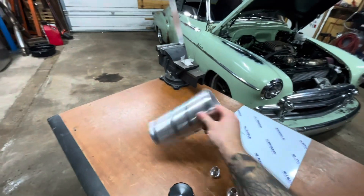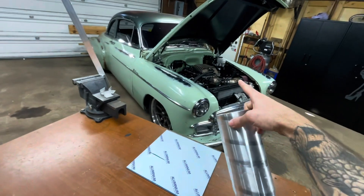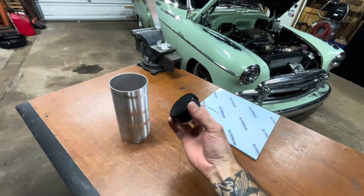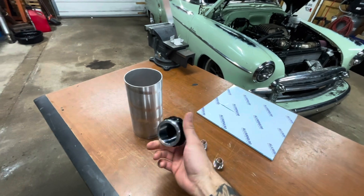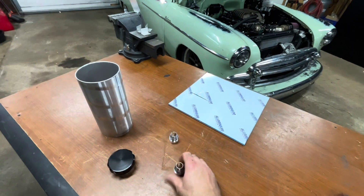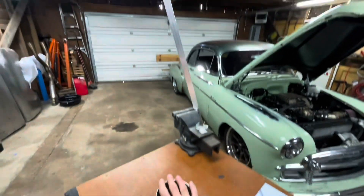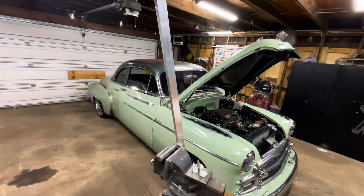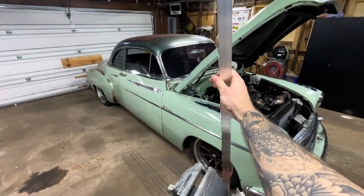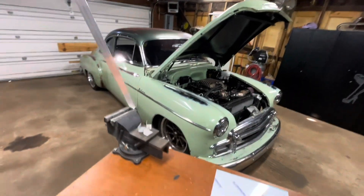Material-wise: 4-inch aluminum tube — I use this for all my intake stuff, but it's just a leftover scrap piece. Got a weld-in aluminum cap, about 15 bucks on Amazon. 12 AN bungs for the inlet and the outlet. An eighth-inch plate aluminum for the cap top and bottom. And then to make the mounting brackets, I've got some one-inch, eighth-inch thick angle aluminum. I think it's going to work out nice with the plan in my head.